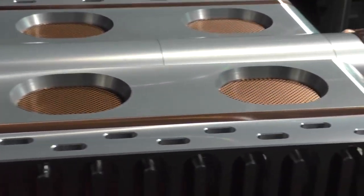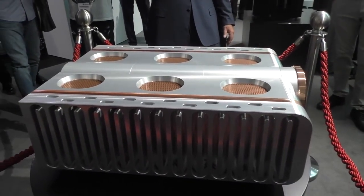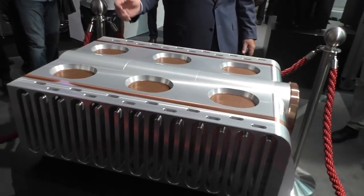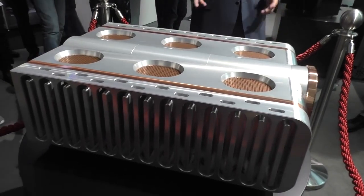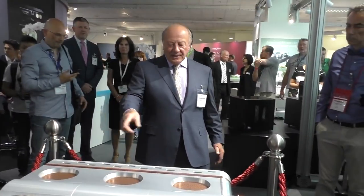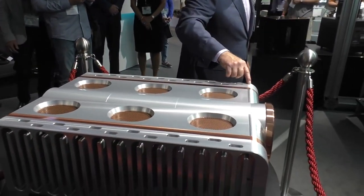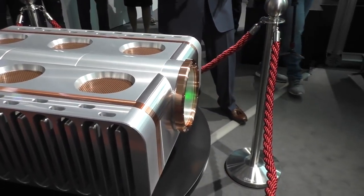So you can tighten it nicely, and it basically won't bend your tines. And I'm not a big binding post fan. That's why I spent a lot of time designing this, making sure that when you tighten something on it, it stays tight and it doesn't move around. It doesn't ruin the speaker lug when you tighten it. On the finishing, this is all diamond cut. The copper's cut and then coated in a synthetic enamel. And the heat sink itself, as I said, is actually an extrapolation of a Venturi. So if you look at it, you can see how it works. And it spins the air around the fin and then out the top. So it's a very intricate design. You'll notice the faceted parts of the amplifiers are all matched up in the machining. So this was done to be a piece of jewelry, but a big piece of jewelry.